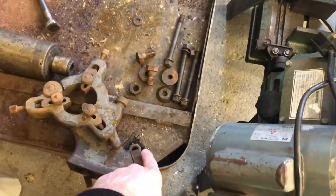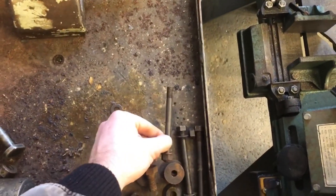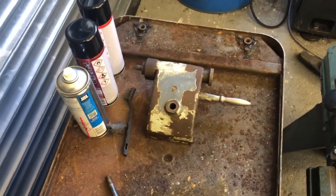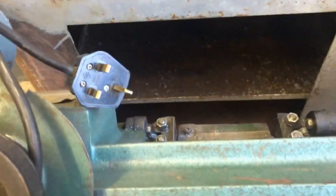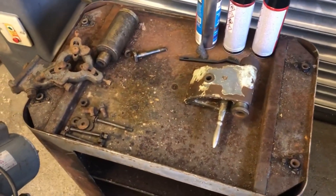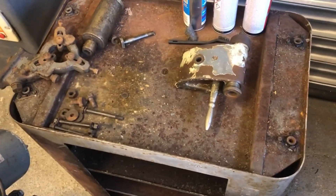The correct steady will go nicely on the other side. It's only got three of the original four bolts for mounting the machine down onto the base, so we'll either source another one or make it in-house. It'll clean up nicely. We should have moved the bands the other way when we did this, but we'll get some citric acid on there to clean all the rust off and see what we've got.